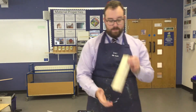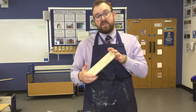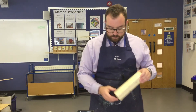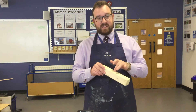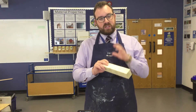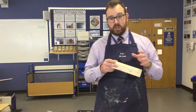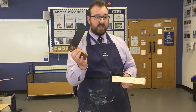I'm going to use a piece of timber — this is bigger than the timber you're likely to use in RMT, but for video purposes it makes it much easier to see what I'm doing. The first thing I'm going to do to find my datum is find a face and an edge that is perfectly 90 degrees — what we call the face edge in carpentry. I'll show you how to find it and how to mark it.